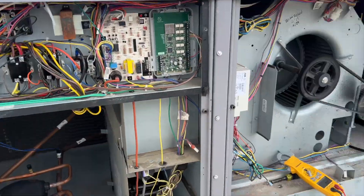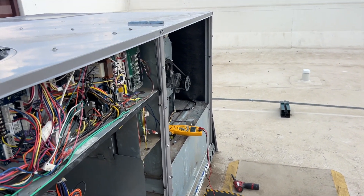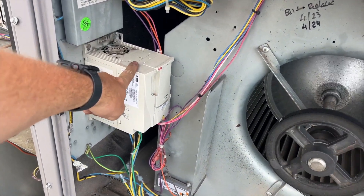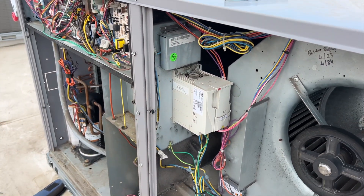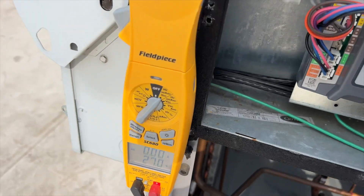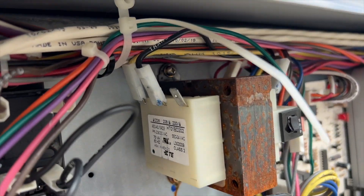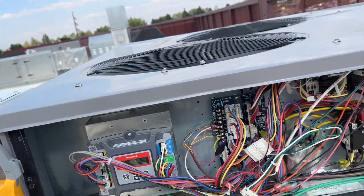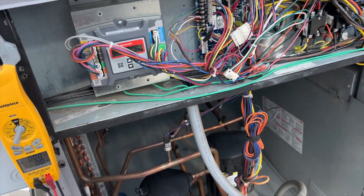Motor's good after cycling power. I suspect this VFD is fried because I should not be getting continuity between it and ground - even in kilo-ohms, that means it's dead. We're going to run it like this over the weekend and order a new VFD. Now we're getting 27 volts instead of 24 because we switched that tap to 208, so it's actually working properly. I just have a call for fan but not for cooling yet - thermostat's probably on delay. The next question is why the second compressor wasn't kicking on.